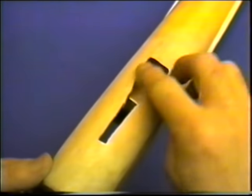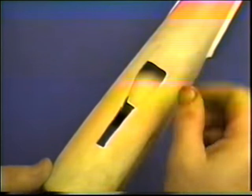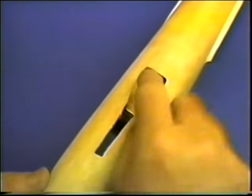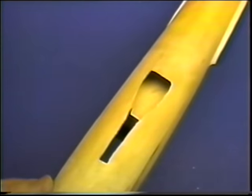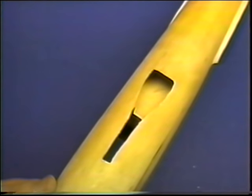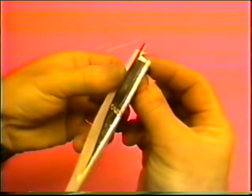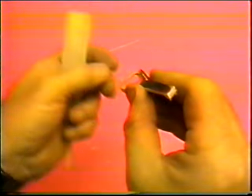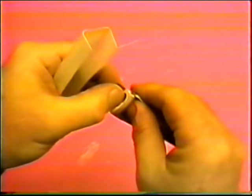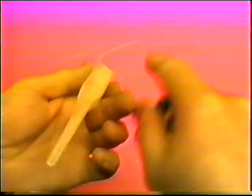Now, of course, we'll have the same outline, but now we have a pattern we can match, so the second piece will go in a little better. I also noticed, and this was something I didn't notice before, in some of the photos of Miss Ashley, that this lip is very thin up here. I thought this had a hole in here. It doesn't. It's like a whole scoop that goes right in, so that'll save us making one bulkhead, too. Having a piece that's a pattern, to me, will be a big help. See, I can kind of lay that out in my mind before I even cut the piece. From looking at the pictures, some of them look like there's a hole in there. But when I looked at some of the other ones from other angles, you could see right in there. So actually, this piece doesn't even belong in here. I would just remove that anyway.